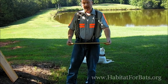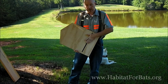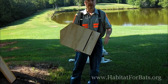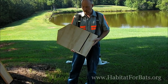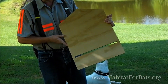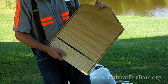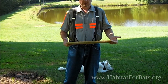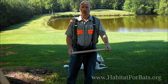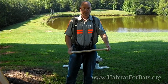AC is a grade — there's an A-face and a C-face, and it's exterior grade. If you go look at construction stores, you'll find what is called CDX and BCX, or CDX and BCX Exposure 1, which is not as durable and is meant for more of an indoor use. You can see that the A-face side is very clean — it's sanded and of high quality. Even the C-sides on the materials we use are typically closer to a B. It's also flatter and much more stable with fewer voids on the inside. We actually tried using BCX for a while, and construction-wise and durability-wise, there's nothing wrong with BC exterior versus AC exterior, except due to the lower grade, it tends to have more variability.